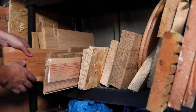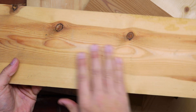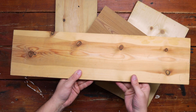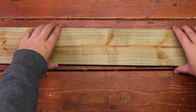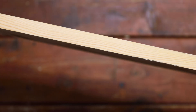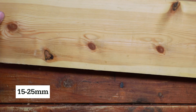We would recommend using recycled wood from old furniture if you can, but there are some things to consider. The best wood to use are softwoods like pine or cedar. These are much easier to cut if you're using a handsaw, and the natural resins inside the wood allow it to last longer, so perfect for a bird nest box. If you're buying new wood, make sure it comes from a renewable source. Also avoid buying pressure-treated wood, as this contains nasty chemicals. Make sure the wood is at least 15 millimeters thick — this keeps the chicks inside from getting too warm or too cold, and prevents the wood from warping.